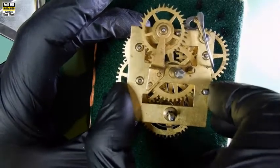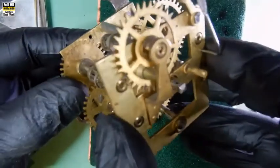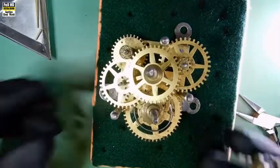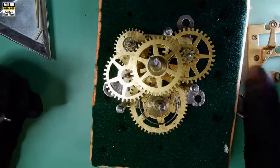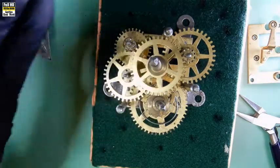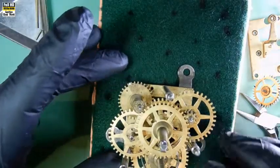Having removed the tapered pins, we can now take the top plate off. There's obviously no pressure in the spring because it hasn't got a spring in it. Right - that's the top plate that's come off. We'll take the escape wheel out of the top plate and put it aside. That's the escape wheel there; we'll check those teeth later on.